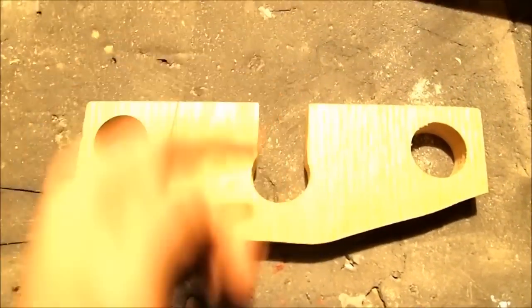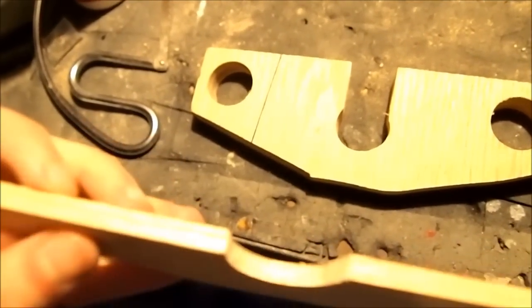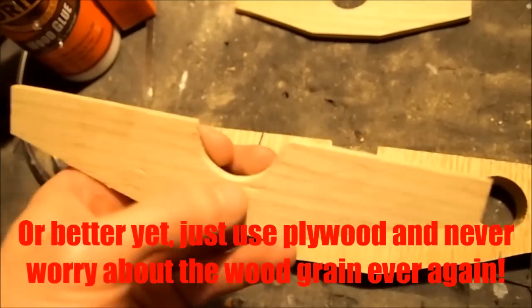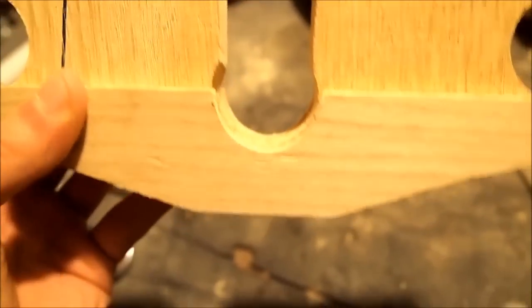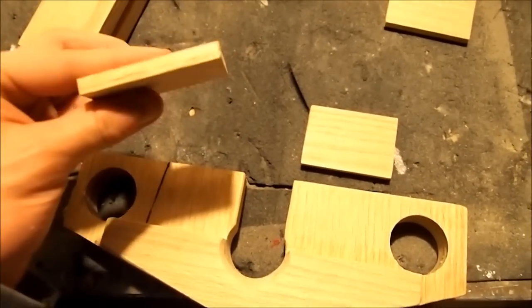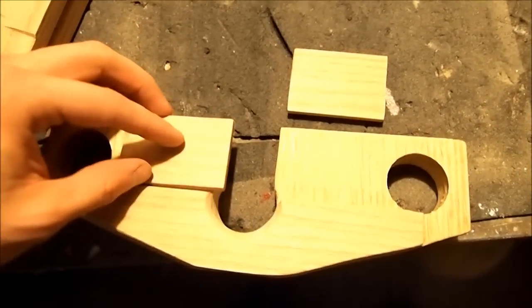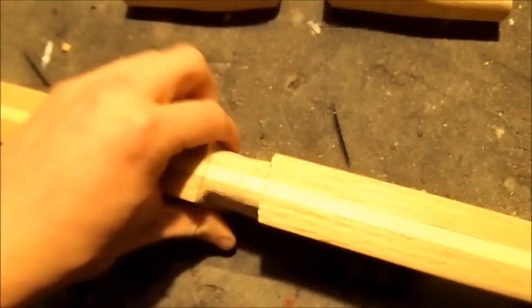Classic rookie mistake: I cut the wood with the grains running the wrong way, so spots like this are really likely to break. The fix is to cut some reinforcement pieces — I just cut these out of quarter-inch oak and glued them on with gorilla glue. The grains are running long ways on these, which is correct. Now that it's glued up, I'll shape it with files and a hammer and chisel. I probably need to put some oak right here too. If you cut the initial piece with the grains long ways the first time, you won't have to deal with any of this.